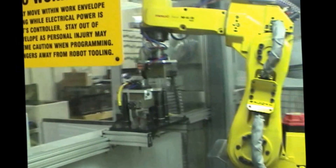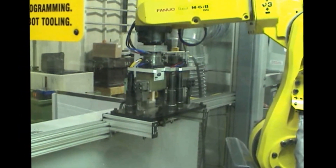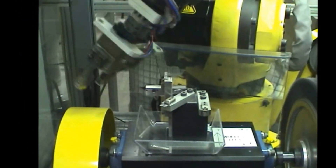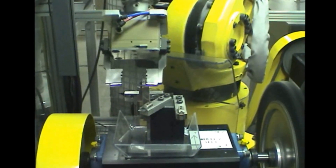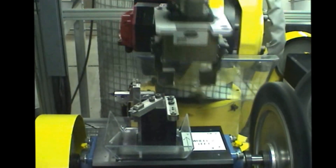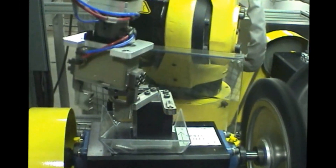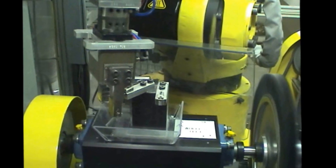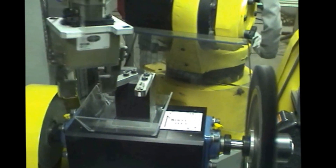We're going to try the other product, so it has to exchange grippers again. It'll pick from the center drawer, and you can see this time around that the skiving operation is much more extensive. All these different surfaces and grooves on this product — we have to touch them all up and knock those big ones out before we can start the polishing process. What we discovered is that if you have a huge burr in the product and then try to polish it, you'll over-polish surfaces that do not have burrs — so that's why this became necessary.